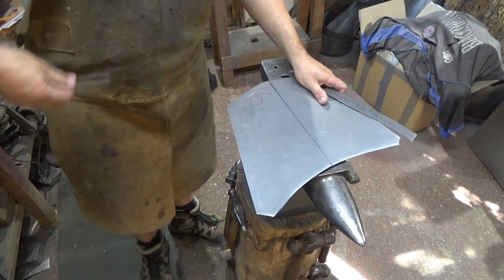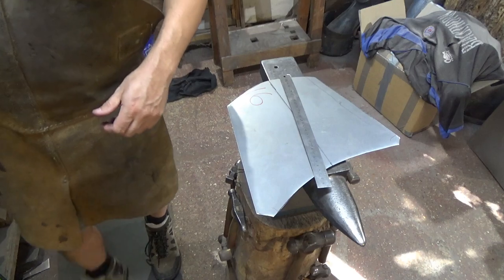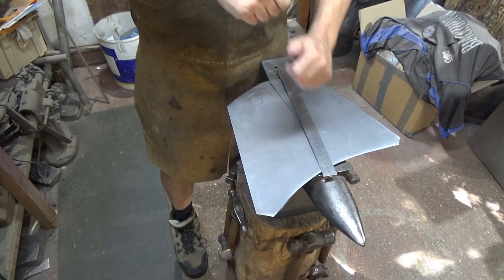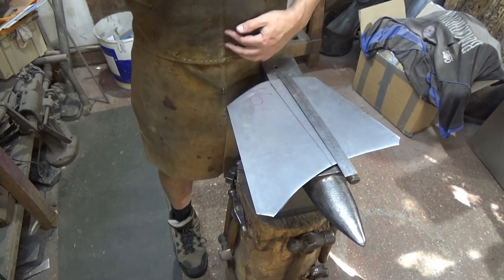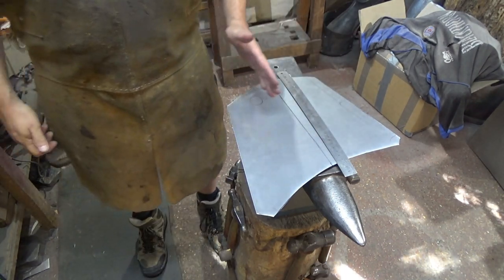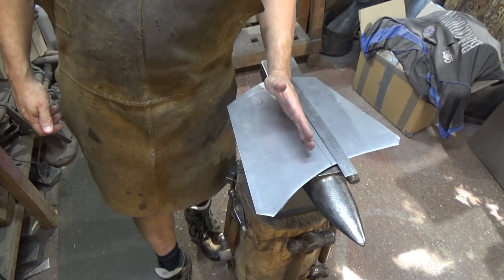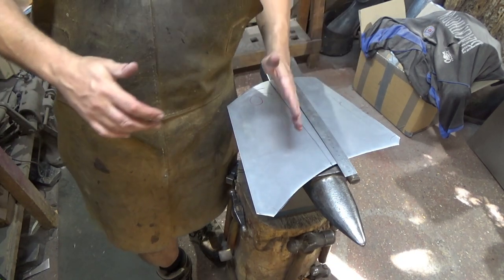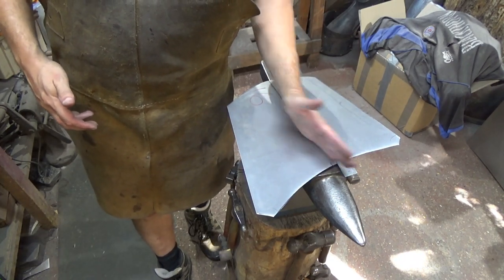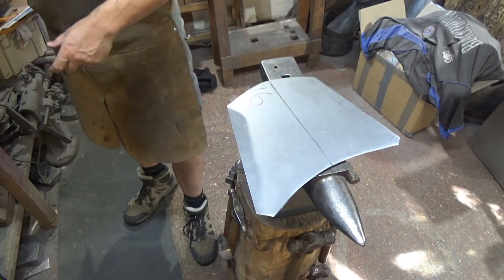I've seen some armor — or where is it — Winchester. There's a really nice, rough-as-hell breastplate in Winchester, and you can see where the armorer at some point smashed in lightly with a chisel these marks to show the centerline of the breastplate running up. But by the time he came to build it he completely loused the job — it runs off towards the top. Rather than do it gently across the length he noticed up here and just smashed it across. So these center lines can help avoid that sort of business.